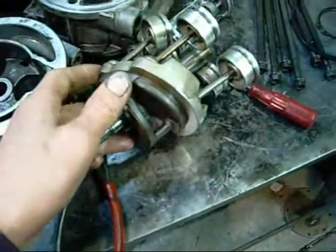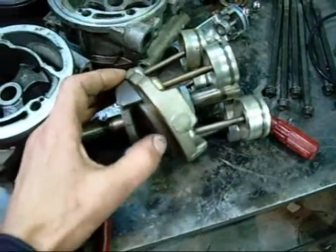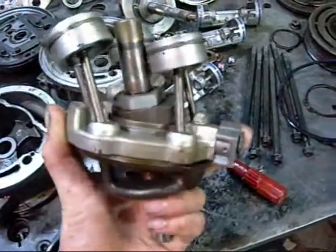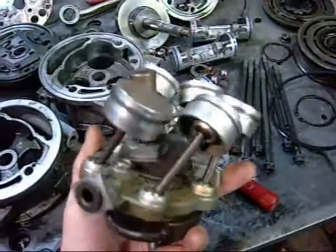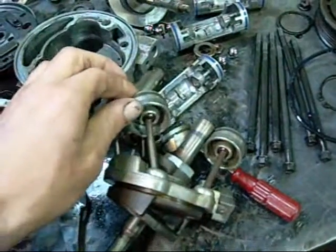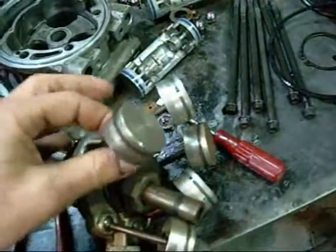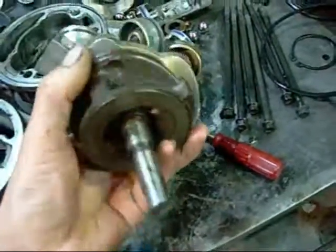I scrapped it a long time ago, long before I got the camera. Basically it just uses a single crankshaft and single thrust bearing, and this plate is kept stationary by this keeper here in the housing, but it's still allowed to drift up and down. Obviously the pistons are pushed and pulled through the bores accordingly. They don't actually have a gudgeon pin or any kind of conrod - they're actually ball-jointed and can rotate, also ball-jointed at the bottom. Kind of a weird little contraption, but they work quite well.